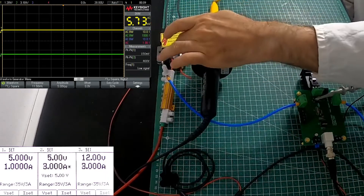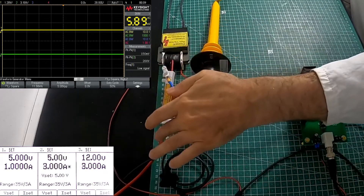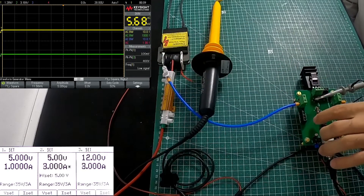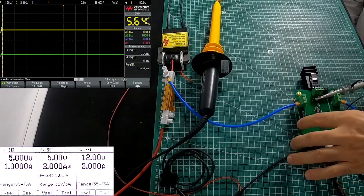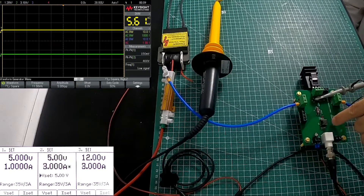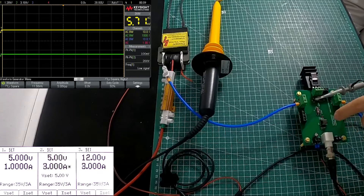The load is a flyback transformer with six turns on each side. I have a center tab with a 10 ohm resistor connected to the voltage source, used for a half bridge configuration in class C. This driver is rated from seven volts in the datasheet, but I have set it to five volt and it works fine. The spikes we see on the gate are not related to the voltage on the driver — they are related to the voltage on the load.